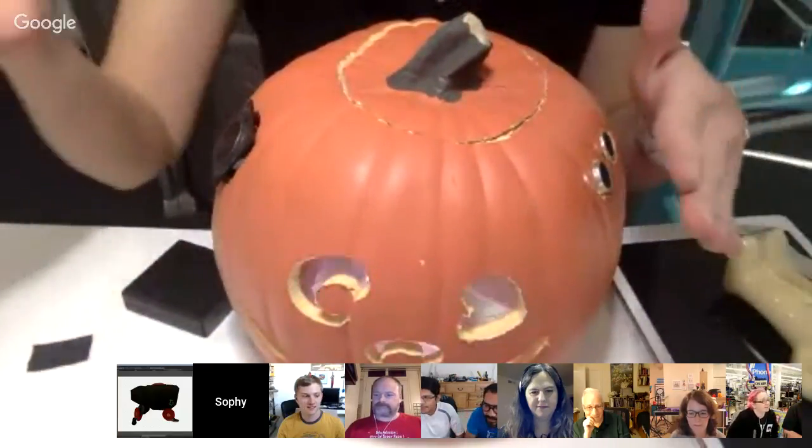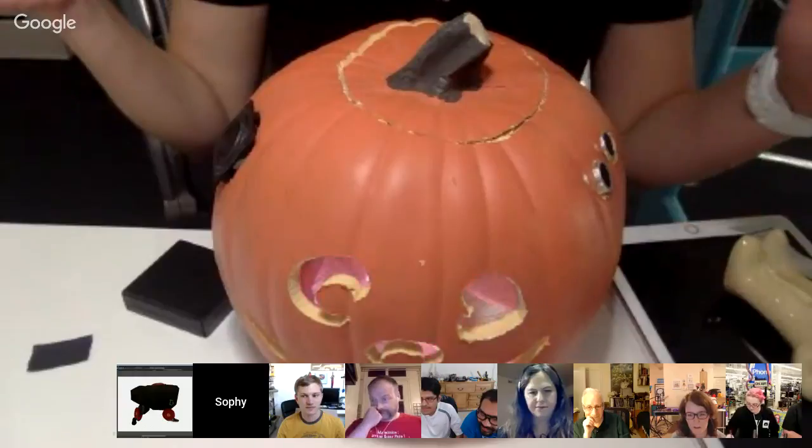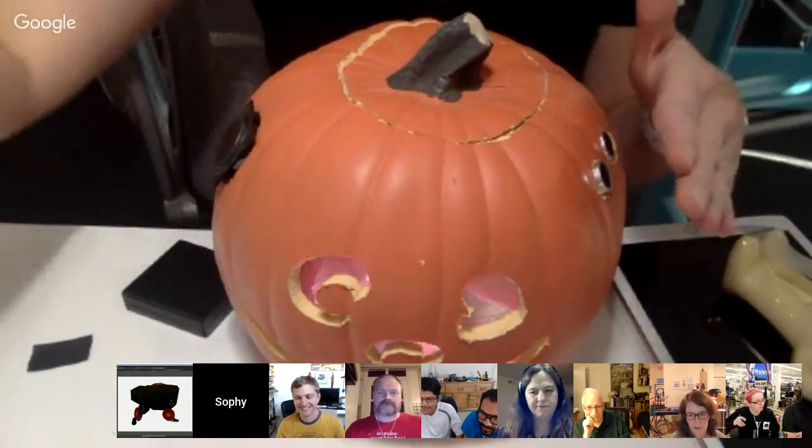Yeah, it's beepy. As I move my hand away, it changes the pitch. It's really simple. It's just taking the distance measurement and converting that into a frequency and then beeping that frequency for a little split second. But I'm so stoked to have gotten it working because I'm pretty new to CircuitPython, and I wrote this in CircuitPython. It's based on a tutorial someone wrote, a learning guide for using this sensor with the Circuit Playground, but they did it in MakeCode. So I had to start over to do it in CircuitPython.